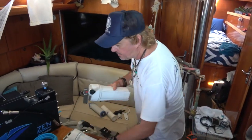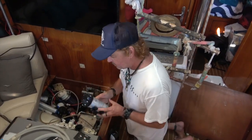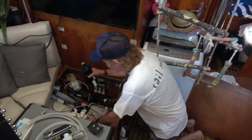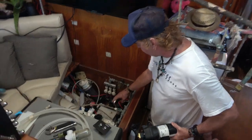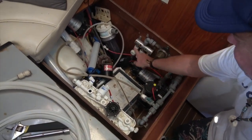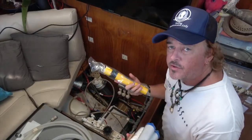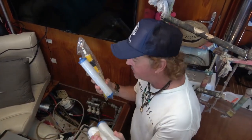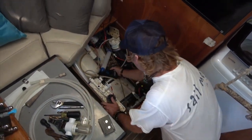I'll open this all up and have a look at what we're up against. This is our pump house and I've got a lot of spare parts in here — spare tubing, spare motors. This is an actual high pressure feed pump for the current RO system. We've got extra pumps, backup pumps, spare parts for the water pressure pump. The main water pressure pump is right here, and the whole manifold system for selecting which tank we're going to use. We've got three tanks on the boat: aft port, forward port, and forward starboard. There's even a spare membrane and spare carbon and string-wound filters we keep in stock.